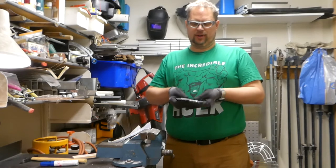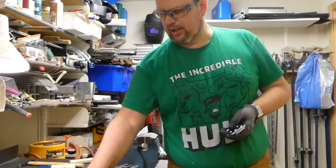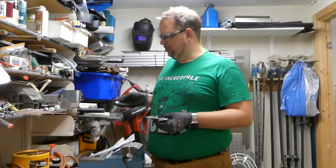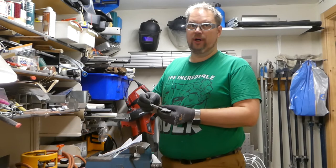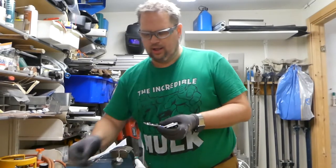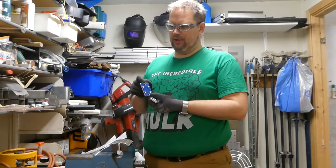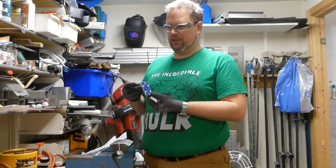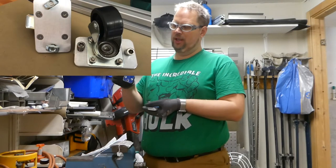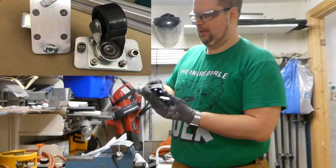So now I have done 4 pieces. I use the same trick as for the bigger parts. I used a washer and just scribed a radius in the corner, filed it into dimension, taking off the burr in the different holes, making them 6.5 millimeters, so there is some play for the lock nuts down to the profiles, and then countersinks for M4, that's gonna hold the wheels, like this.